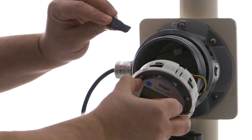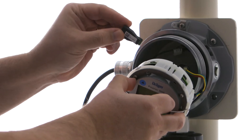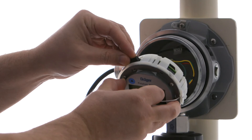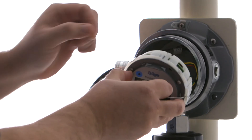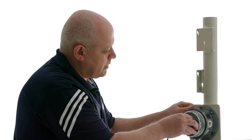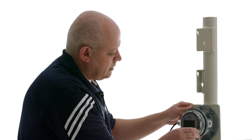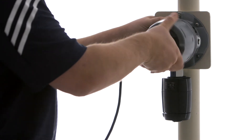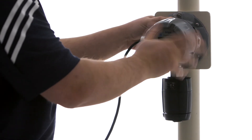On one side of the diagnostic dongle is the Draeger name. You want the Draeger name to be facing away from you, and we're going to simply put it in the slot. That's what it should look like. Then put the electronics assembly back and screw the faceplate in.